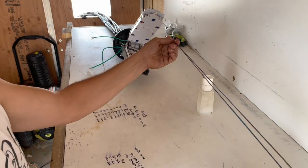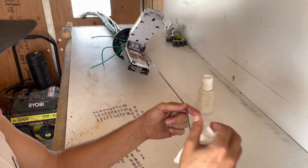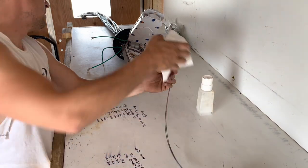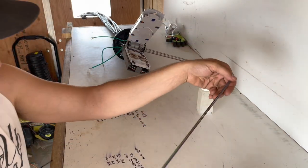And when wiping these, do not be pinching super hard. Because if fibers are overlapping each other, which is going to happen, if you pinch too hard, you're going to snap one of them. Telling you now. Just a light, firm grip. That's all you need. All right.